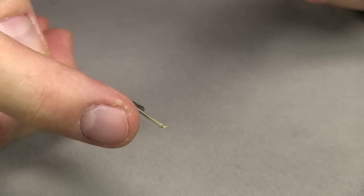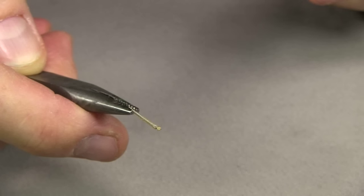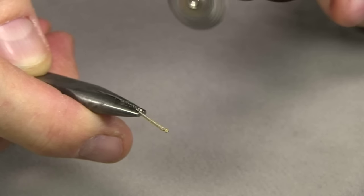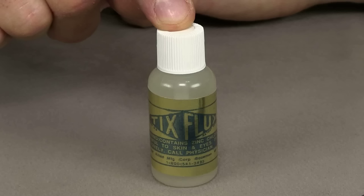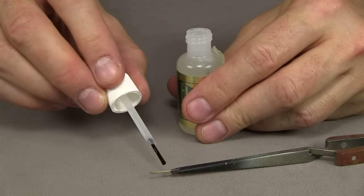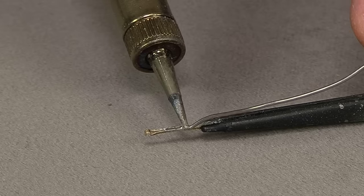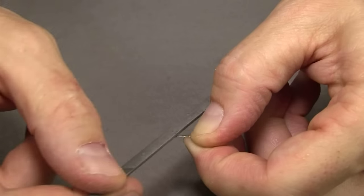Another little wrinkle up front is that the two very front stanchions on these SD40-2s actually have the little channel filled in, instead of looking like a channel like the rest of them. I want to fill that in with solder, and to do that I need to clean it up first using a wire brush and a motor tool to polish it a bit. I found this Tix Flux — someone recommended it to me. I'll brush it on the stanchion I want to fill in, hold it in a sprung tweezer, heat it up and flow some solder into it. That took like two seconds! Now I can use a file and sandpaper to smooth this out and make it look flat.